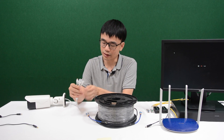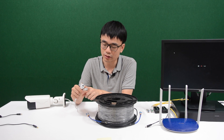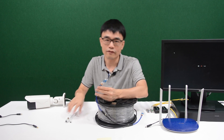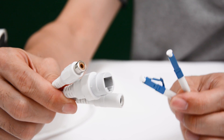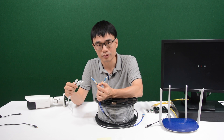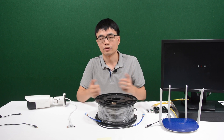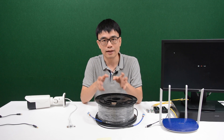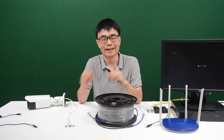First, let's check the connector. You can see the camera has the power, also the RJ45 network and audio input. This is the pre-made fiber optic cable. You can see we cannot attach the fiber optic cable to the RJ45 network port directly — it's not going to work. The size is different, but technically they're using different sources to transmit the signal. The fiber optic cable uses light to send and receive the signal, and for the Cat5e or Cat6, it's the electronic signal.